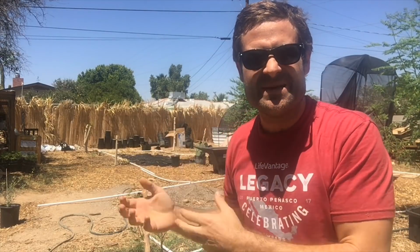So here we go. Some of the factors that you're gonna wanna keep in mind before you start building your irrigation system is how many trees are you gonna have, or what kind of plants are you gonna have on your system. If you're gonna have trees, you're gonna wanna really think about deep watering. If you're gonna have bushes and shrubs and flowers, there's different kinds of watering for those. I personally like using PVC with bubblers and some other spray heads for different purposes over drip line.